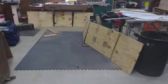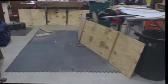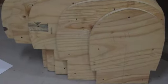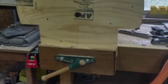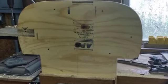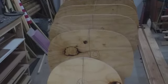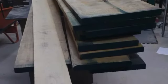Then we started working on the forms — just plywood. We took some poster board, cut those to shape, then took those to the bandsaw and jigsaw, cut them out, and sanded the edges smooth, because that's what you're going to build off of. The forms then got attached to the backboard piece.